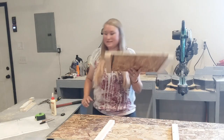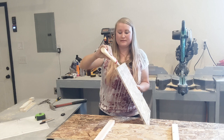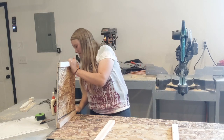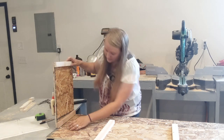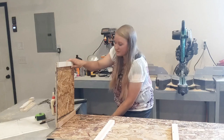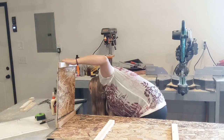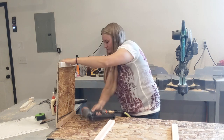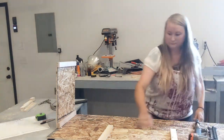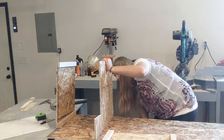To connect the walls, I lined them all up to make sure I'm going the right way, because unstapling and ungluing things is not fun. I run a bead of glue right down the bottom, stick it on, and line it up with the edge. Then in order to flip it to nail from the top, I'm going to reach the nail gun underneath and staple it from there for a couple of staples, and then I'll flip it over to finish.